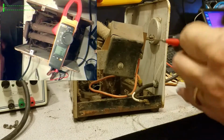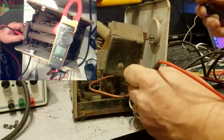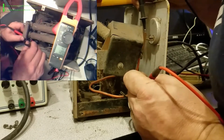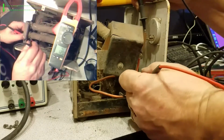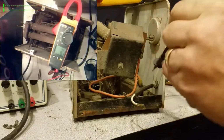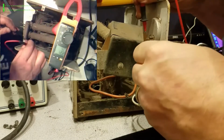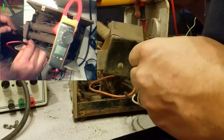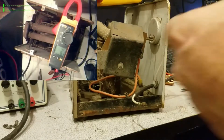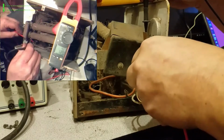And this is a red wire, so I am guessing this is here. But I put the red wire in, so who knows. And then here's negative. And then reading 12 volts, positive. So if I turn this around, I should see the opposite, which would be bad, right? Minus 12, right? Yes, sir. So the positive, when I put the red on the bottom, it reads positive. So this down here gets the white wire, this up here gets the black wire.